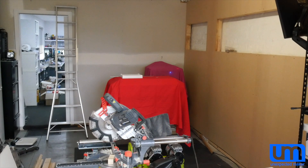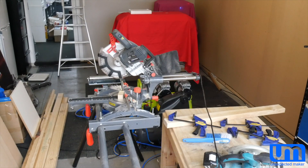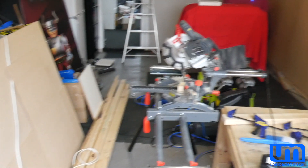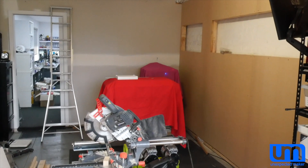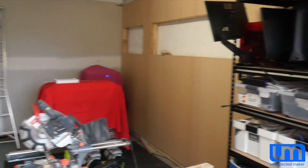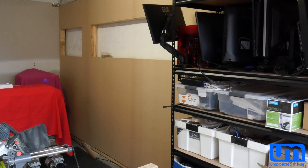It started raining so I had to move all of my tools back in. I generally move my saw, workbench, and everything out of the garage when I'm working so I don't get sawdust everywhere. But I've had to bring everything back in, including all the timber — typical Melbourne, it's been sunny all day and now it's started raining. So far, what I've done is I've taken this wall and framed it up with insulation behind all of the MDF. I'm just using MDF, not plastering — I just need it to be insulated and cleaner than before.